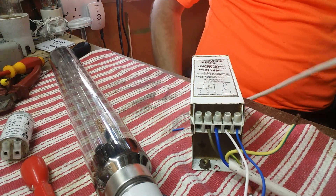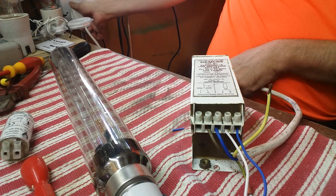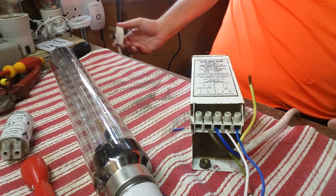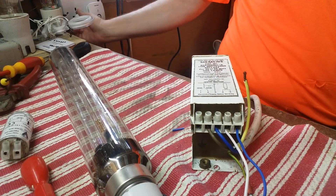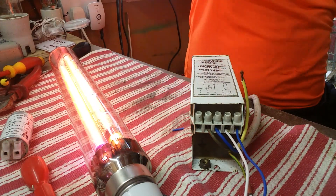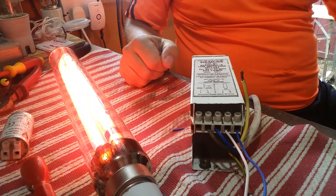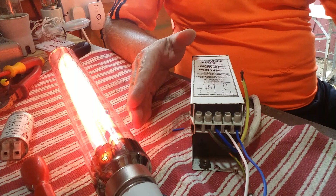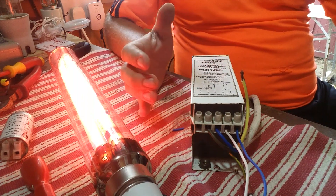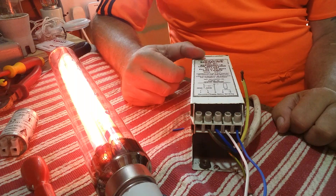Let's see if we have life out of this one. Get the plug in — the pins were a bit gone on the plug. There we go — and now we can see that the sodium tube is now lit! You can hear it on the camera — it's a nice hum buzz. The buzzing will gradually get quiet and go away as the tube brightens up. So we know this one is fine — the 55 watt side of the ballast is good, whereas that other one is going to require a 55 watt external igniter.